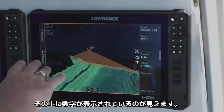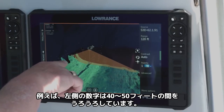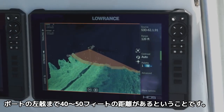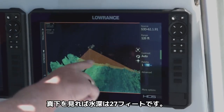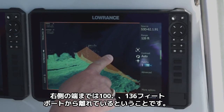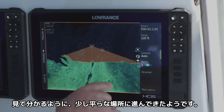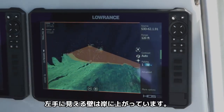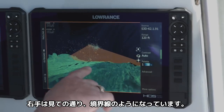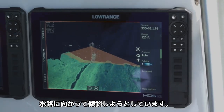As you look at this line here, you see some number readings and you may ask what they are. On the left side, this number that keeps changing between 40 to 50 feet means it's looking 40 to 50 feet to the left-hand side of the boat. Right here straight down, we're in 27 feet of water. And over here on the side, we're looking about 136 feet out to the side of the boat. You can see we've kind of come into a little flat right here — the wall on the left-hand side is where it goes up on the bank, and on the right-hand side you've got some ridges where that rocky bottom is moving in towards the river channel and starting to slope down.